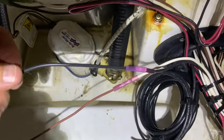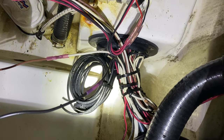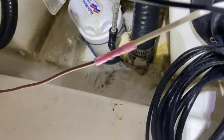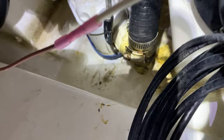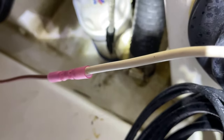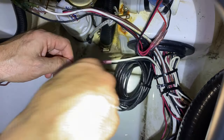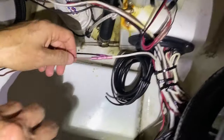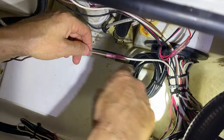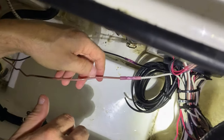We have a good seal on both sides — it's wrapped all the way around like it's supposed to be. It looks pretty clean. In comparison to the other connection we still have to do, there's going to be a gap there that we're trying to close with the heat gun. If saltwater gets onto these wires it causes corrosion — not just at the butt connector. The corrosion actually travels into the wire and acts like a cancer, ruining the impedance of the wire so it doesn't work anymore.